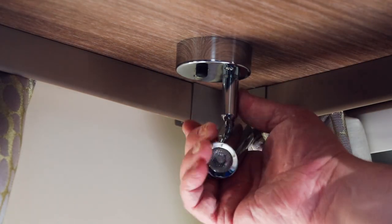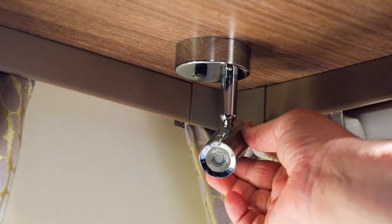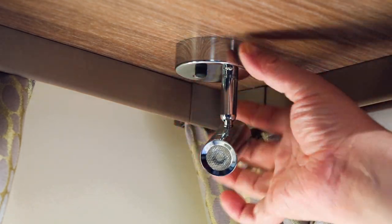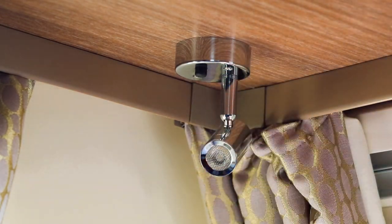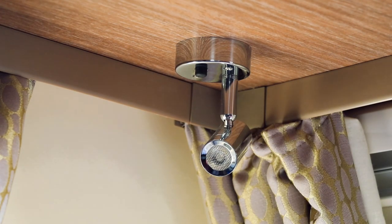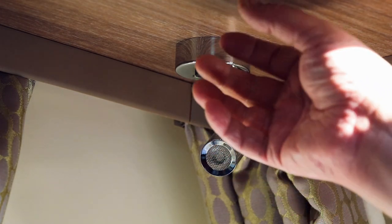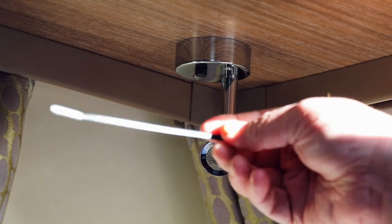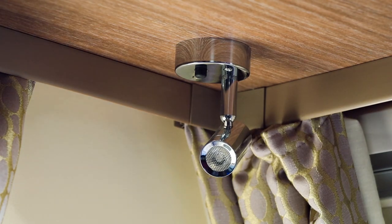So this is the one we're going to replace. It's at the front of the caravan and as you can see it's got no USB sockets on it whatsoever, and if I switch it on it's ridiculously bright — hence the reason why we want them dimmable. It's very easy to take this one off. Some of them, if you've got down lighters already, they just twist and they come away. This one's got two screws in it and we just need to unscrew it completely and then the whole light will drop out. Now before we do that, a word of caution: some of these caravans are wired up before the sides go on, so getting hold of the spade terminals is not particularly easy — you'll probably find you've got very little give. If that's the case, use a cable tie to hook around the cables so that you don't lose the spade terminals if you uncouple them, because what will happen is they'll spring back inside and you'll never see them. I know that from experience because that's exactly what happened to me just a few months ago doing the other side.